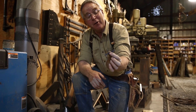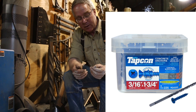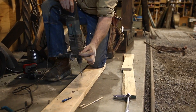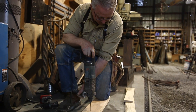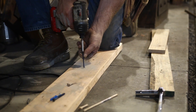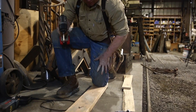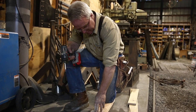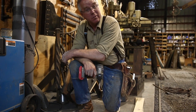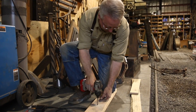It's called a tap-con screw. That's a very hard, slightly abrasive, serrated screw on that shaft. I'm going to drill an eighth-inch diameter hole, and then I hope I can run this tap-con down into the concrete without breaking it. Look at that — gone. That's a very nice, very fast connection. Now in many cases that can replace the old-school thing of driving nails in. But if you don't want to do that 10,000 times on a tilt-up job and want to save money by nailing, it's a wonderful, very slick thing.